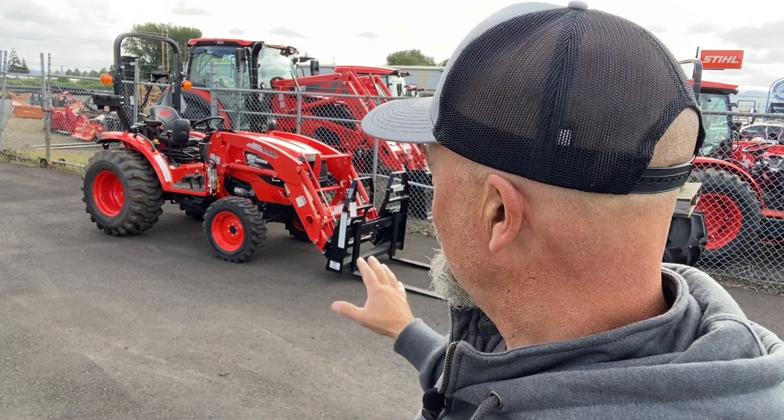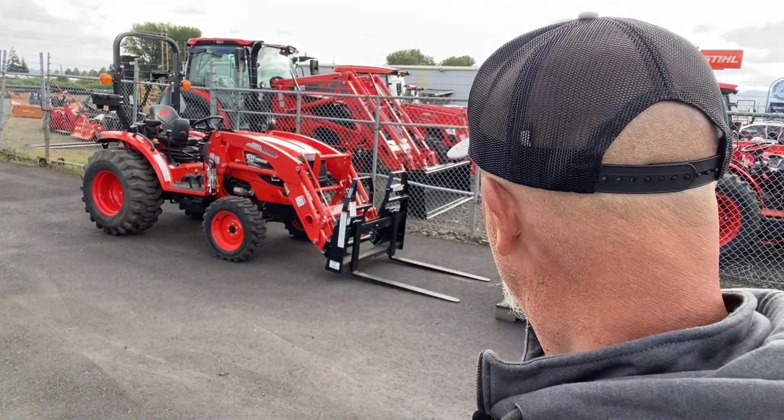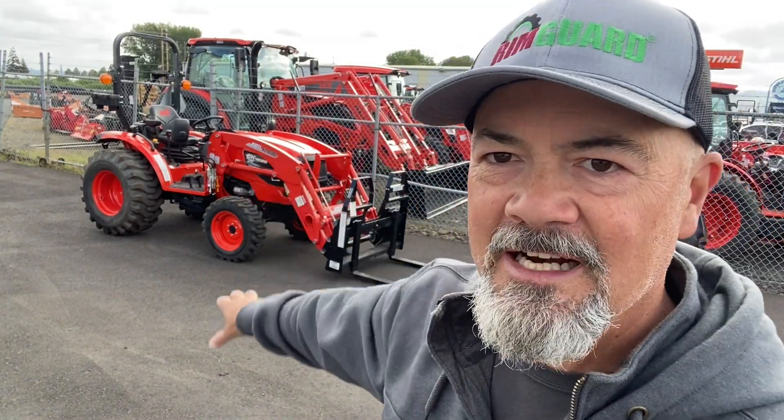We got on some flat ground with this unit. This tractor is a new tractor with unfilled tires, and we're going to be testing lifting up the weight of these four tires with unfilled tires in the back. What we find out about these compact tractors is that they have the capability to do a lot, but they need the ballast — and that's one thing they don't have. Even when you add implements in the back, it can be different for you.